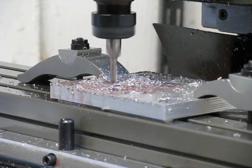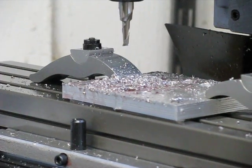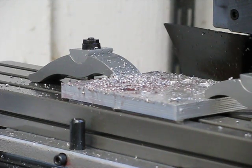That took about a minute, which is about half the time that it takes with a regular profile-type milling operation, where you plunge 30 or 40-thousandths and mill around the profile and plunge another 30 or 40-thousandths straight down.